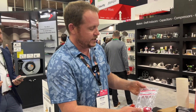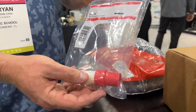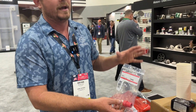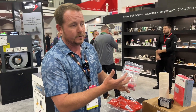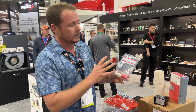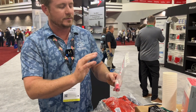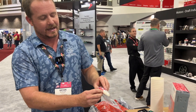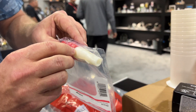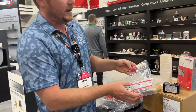The final thing I want to mention is the 230 DLF-18. This actually came up recently in one of our service meetings where my own service manager was coming up with some workaround way of connecting the drainage tube for a typical high wall unit, and I pointed out to him that this exists. If you do a lot of ductless installs, you definitely need to be getting these adapters. Diversitech has this one built right into this kit. It has a nice stepped design so that it works with a lot of different sizes of tubing, and it connects directly to the end hose off of your standard ductless manufactured heads.